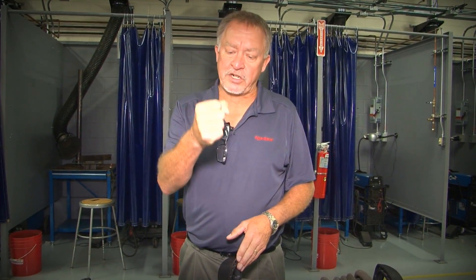If you have the torch mounted firmly on a CNC cutting table and you're cutting a bunch of half inch material, the torch has to stay right in place and pierce every time before it starts cutting. With a 45 amp plasma, if you pierce much thicker than about half inch, then you're going to cause some damage to the consumables and wear them out inside the plasma torch. So the pierce rating and the production rating are essentially the same thing.